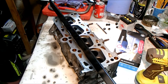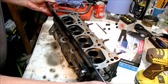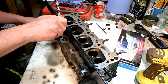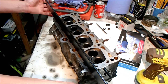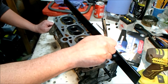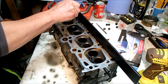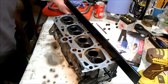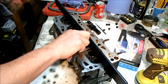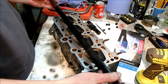You can also check behind with light — if you see any light underneath it, there's a gap. So far, so good — actually looking very flat. Just to see how fine a tolerance it is I've switched down to the 0.05mm gauge to see if there's any clearance, and so far I am getting nothing, which is really encouraging.